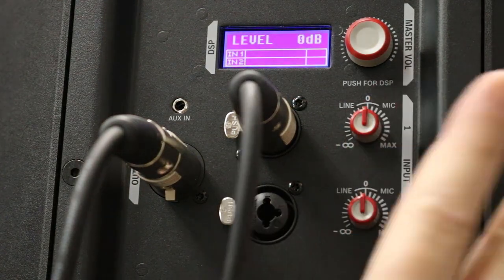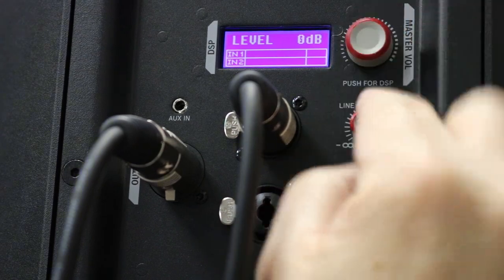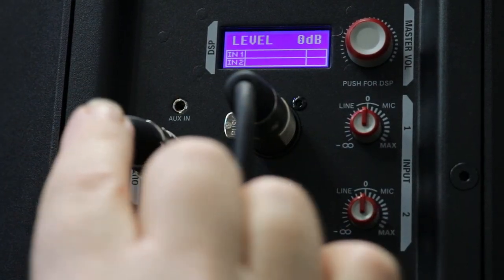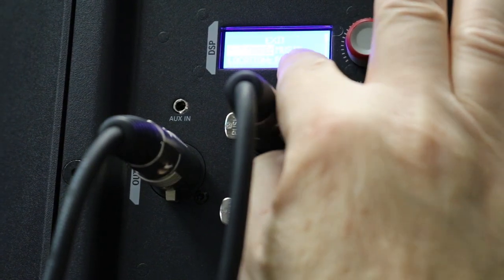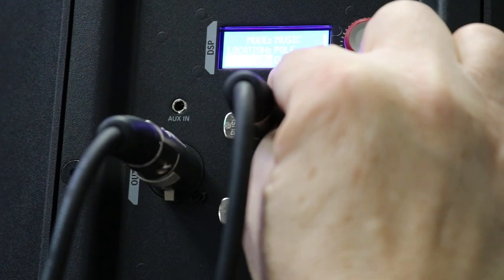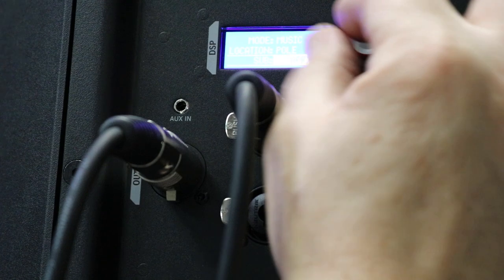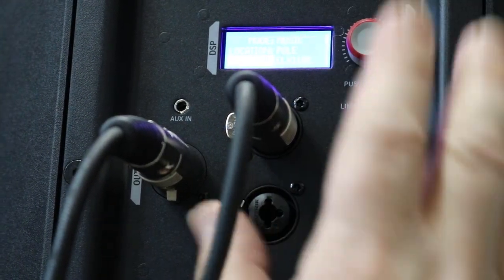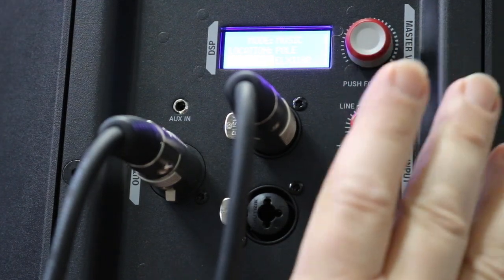So now we're in the back of the actual ZLX 12P — and the 15P looks identical — so we'll cover all the bases here just to show where we actually have the units set up. The levels were set at zero, no extra, and the manual gains on the actual units were left at zero. We were only plugged into one line up on top and we're using the line out to go down to a subwoofer. If we look in here by pressing the menu button, it goes into the menu settings. I'm in music mode — that's the EQ DSP setting built into it — and it was on pole mount because that's how I had it set up. I also had it set at the ELX118P for the subwoofer. The speaker has the ability to adjust to other subwoofers and to also be turned off. I have frequency adjustments on here as well and a bunch of sub inputs. So we were using the processor in the ZLX to tell the ELX what to do sound-wise, and that's why we got such good response out of the subwoofer.